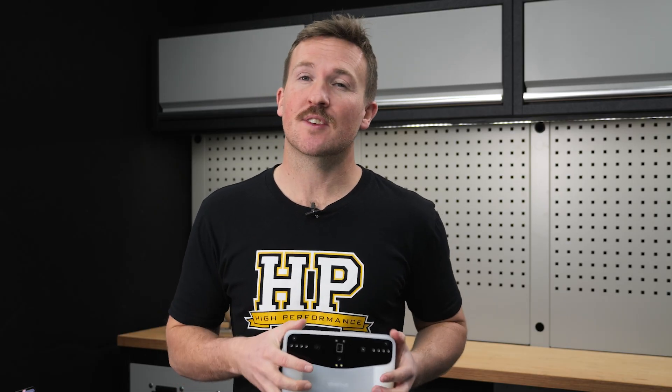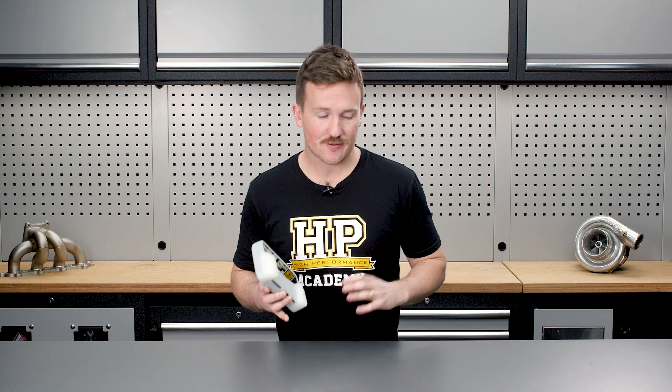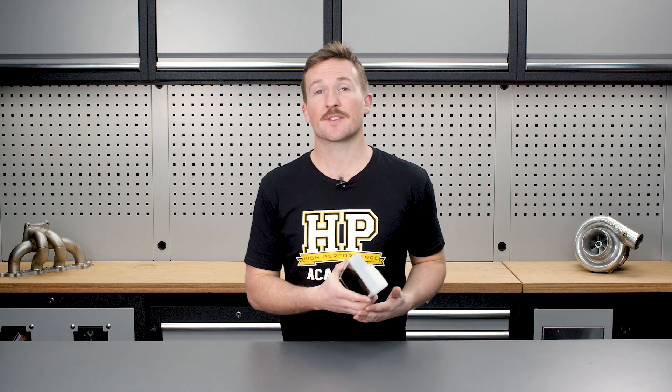The fast mode uses infrared VCSEL as the light source — a commonly used technology found in most structured light 3D scanners. It's great for efficiently capturing data and dealing with a wide range of conditions, so it's great for working in the workshop. The HD mode uses infrared MEMS, which is a very similar but tunable light source — better for finer detail and higher resolution, though less efficient. The idea is flexibility to cover all the bases, from very small detailed scans of smaller parts to larger scans of bigger parts or perhaps the entire car.